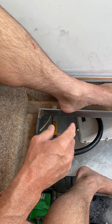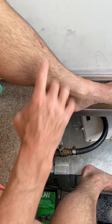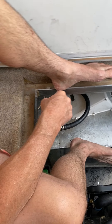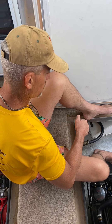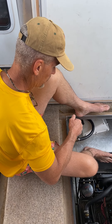As you pump out of and empty that toy tank, you'll turn that valve off, turn the starboard valve on, and pump from there. Then if need be, you'll empty that tank, turn that one off, and turn the port side tank valve on and fill from there, leaving this tank as your very last tank — a last reserve to be able to get home on.